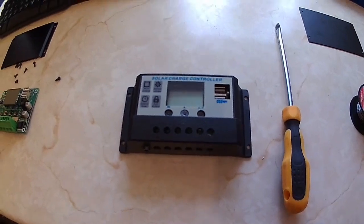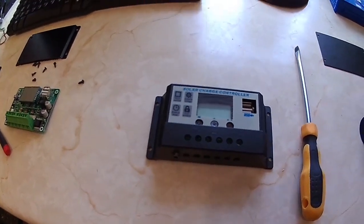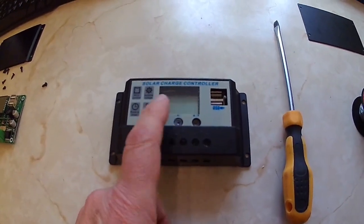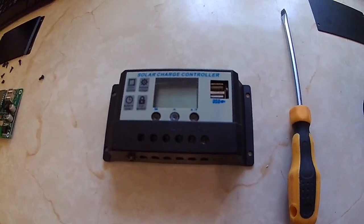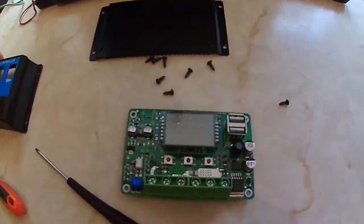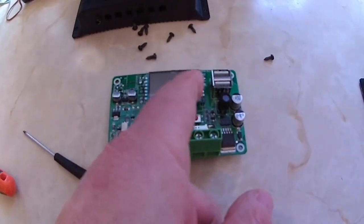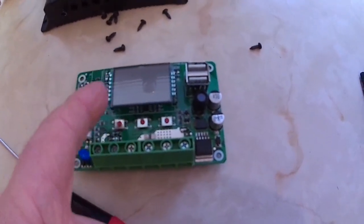Okay, I'm back home doing a post-mortem on the solar controllers. To recap: the original one that was in the van lasted two years. For some reason it was reading the wrong voltage - the display was reading 15 volts so it wouldn't put a charge into the battery. The replacement one went faulty after a couple of days - the display failed on the least significant digit, so rather than read 13.8 it would read 13 point nothing.